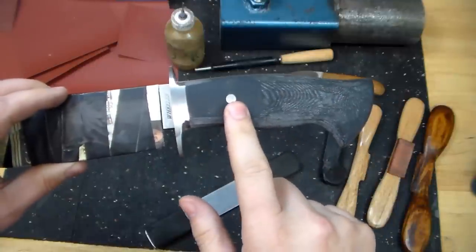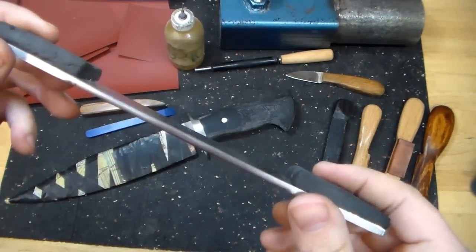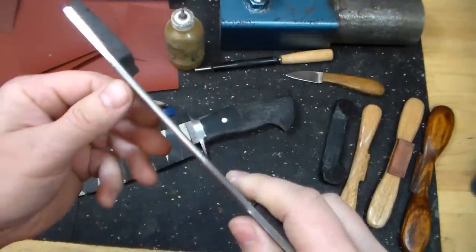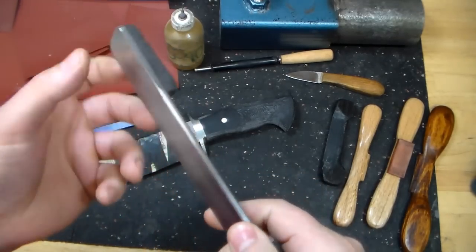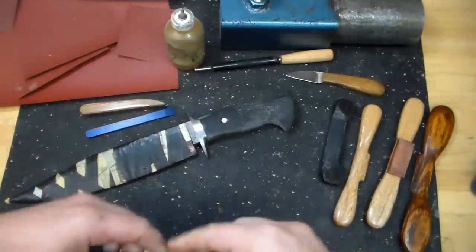And so the next step for me to sand this area out, I use a very rigid backer, this simple steel bar, and notice I have a radius on my leading edge. A sharp corner will tend to either dig in or want to tear our paper, which we want to avoid both of those things. So this is what I use to hand sand this area.